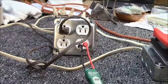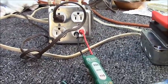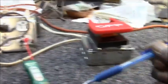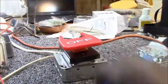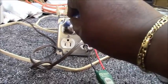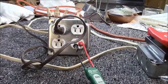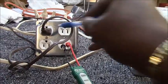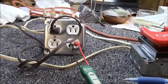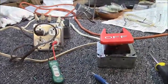We're going to hook up the outlets here for the saw and for my dust collector, so whenever I turn this switch on, my saw comes on as well as my dust collector. I'm running the saw outlet so I can leave the switch that came with the saw on all the time, and if I'm not using this setup, I can always unplug the saw and use it directly to an outlet with the original on/off switch. Everything is working, so let's go forward and do the final connection to the saw itself.